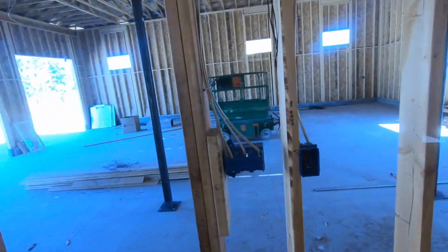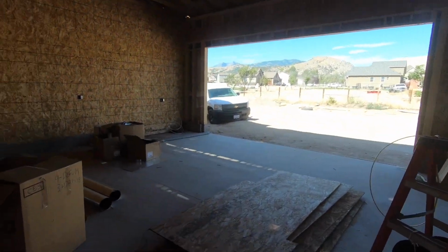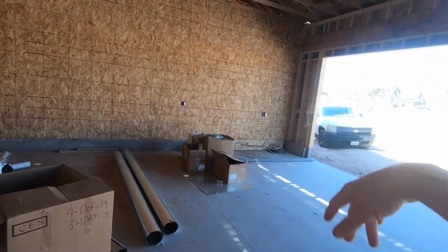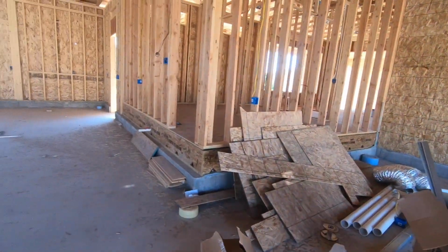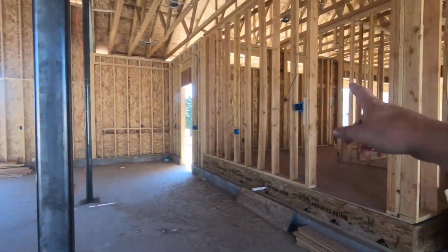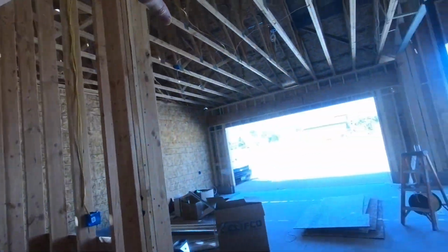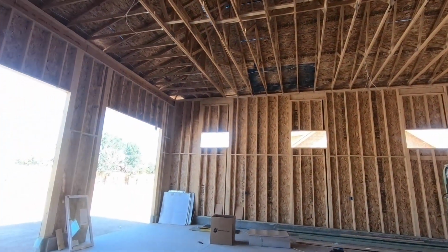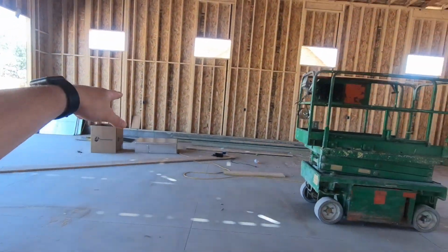And then for the garage is pretty complicated. Did a car charger there, and I think we'll all have electric cars in the future, so we don't want to have to add that later on. So car charger, some outlets, pre-ran all of the wires for the garage door, so they'll all be in the walls and there won't be any of those wires stapled. You have the garage door outlets on both of the big doors, some lights, and the garage door wires, and then there's plenty of lights, outlets all along the wall.